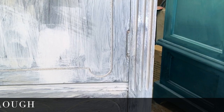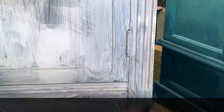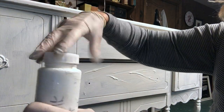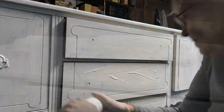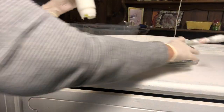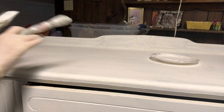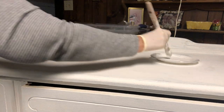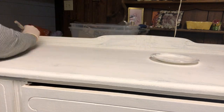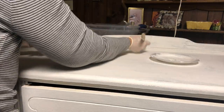When the shellac was dry, I filled my FIFO bottle — which means first in, first out — with White Swan and then painted the piece another coat using my little Frenchy brush and my sampler brush. I painted the piece with three coats of White Swan total, letting it dry a day between each coat.